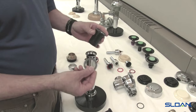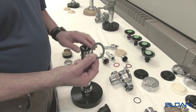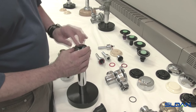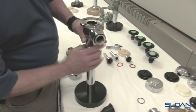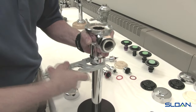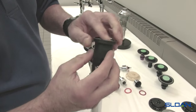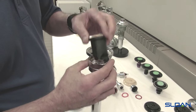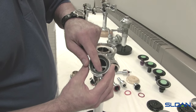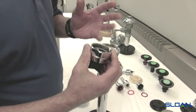When installing the vacuum breaker assembly, once you install the kit after the tube has been cleaned, we have our fiber gasket or friction ring. Once you install it and put the coupling on, hand-tighten it and then just snug it up with the wrench — that's all that's needed. The pliability of the gasket doesn't take a whole lot to put a nice squeeze on there. When it's inside the coupling it's captive so it won't mash outward, but if you over-tighten it you will crack or force the baffle to bend inward and create a gap. This is why it's hand-tightened and just snugged with a wrench.